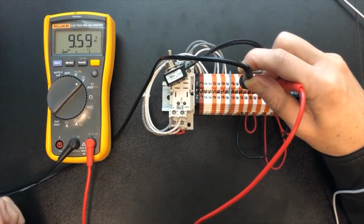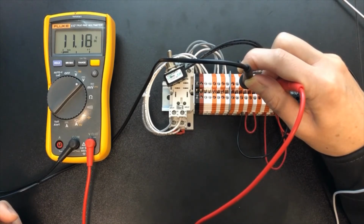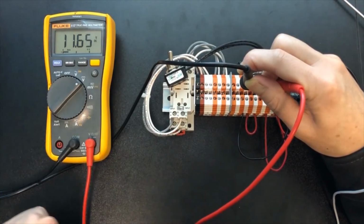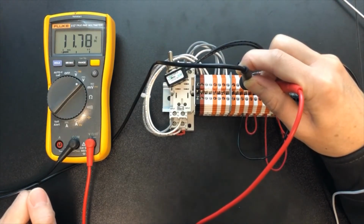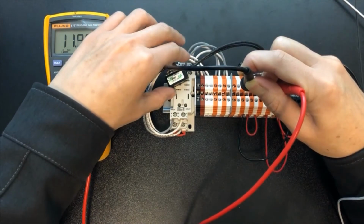Right? You need to wait at least 70 seconds to see it fully charged, and to see the fully charged curve. And the 5 tau is 50 seconds, right? After 50 seconds, the reading should be very close to 12. All right. Also, make sure that your DMM is measuring the voltage. Okay, once it's fully charged, the time is done, you can turn off the switch.